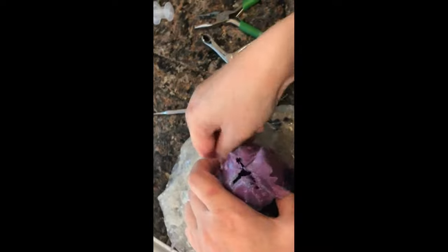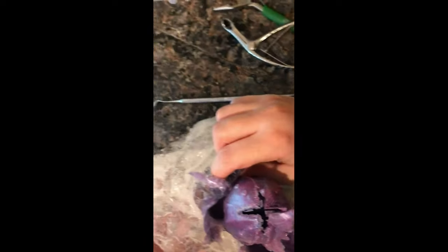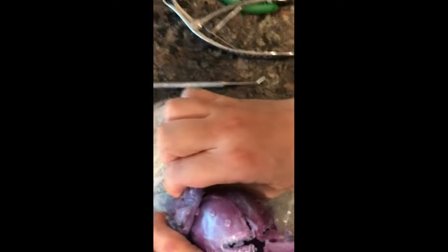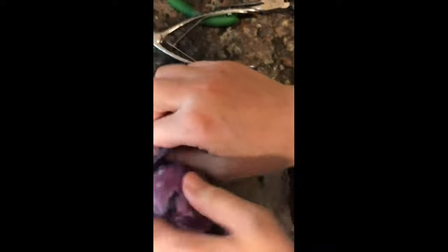Someone said to me, wouldn't it be easier to put holes in the mold so that you can inject air or water into it to release it. And I can't, because all the surface detail here is where I would have to drill the holes. And I can't disguise them then. I'd have more trimming to do. And the other thing is I found trying to release silicone from this level of detail, it requires so much pressure on the syringe, I physically can't do it. I would need a machine to do it, and I don't trust not having the tactile control over anything. I need to feel everything that I'm doing because everything's so delicate.